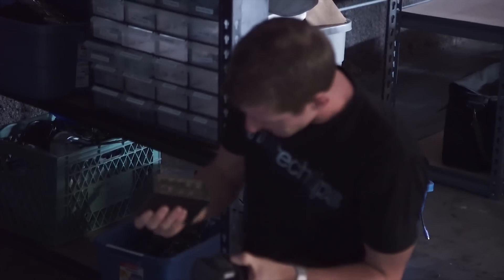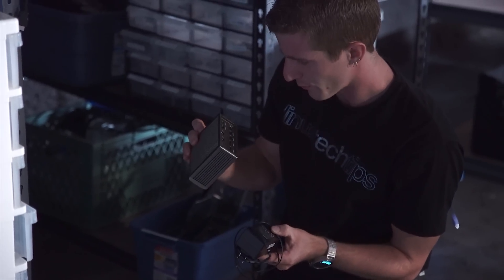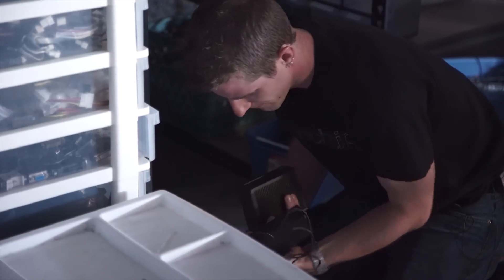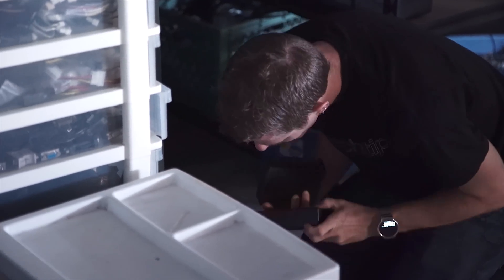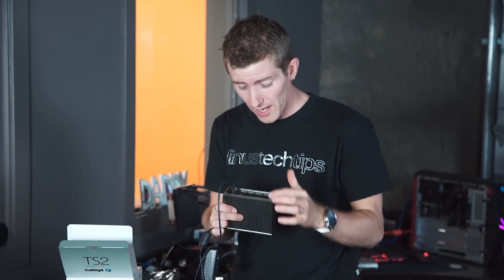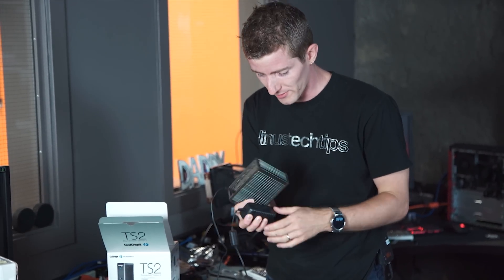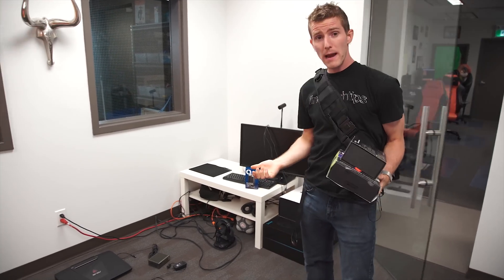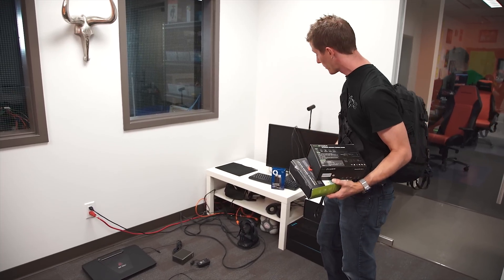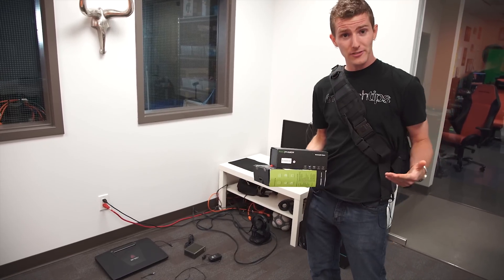I found this KTEC 12-volt 3-amp thing that fits, which I'm hoping is enough, because this would be over-specced to allow for a bunch of devices to be plugged into all the USB ports. But speaking of power — if we're not going to power the Vive through the original tether, and we're not going to power it through the Thunderbolt cable — which we're not because optical cables do not carry power — we're going to have to do something else.